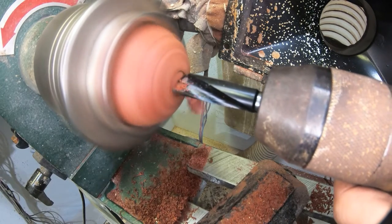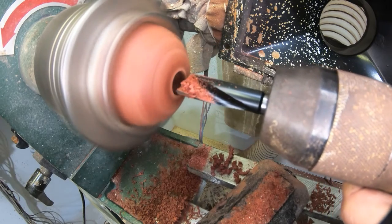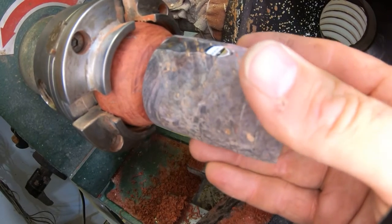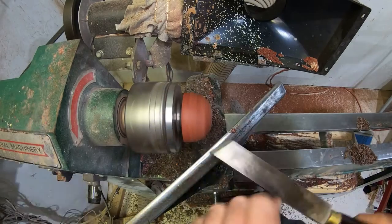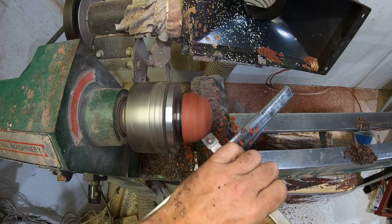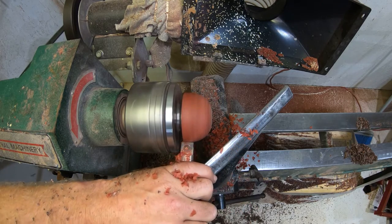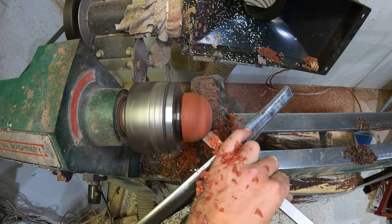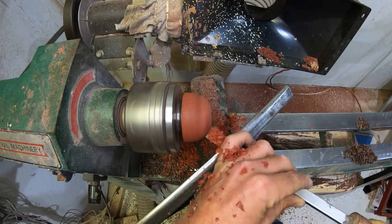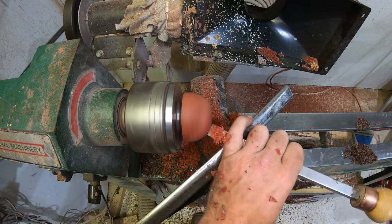Here I'm boring out the hole for the wood plug that will be made into the, there you go, ta-da! Just boring it out. Like I said, if you plan on doing something that's glued up and you're kind of worried about getting it centered, that kit right there doesn't come with the appropriate drill bits, but the wood plug cutters are perfect for it.